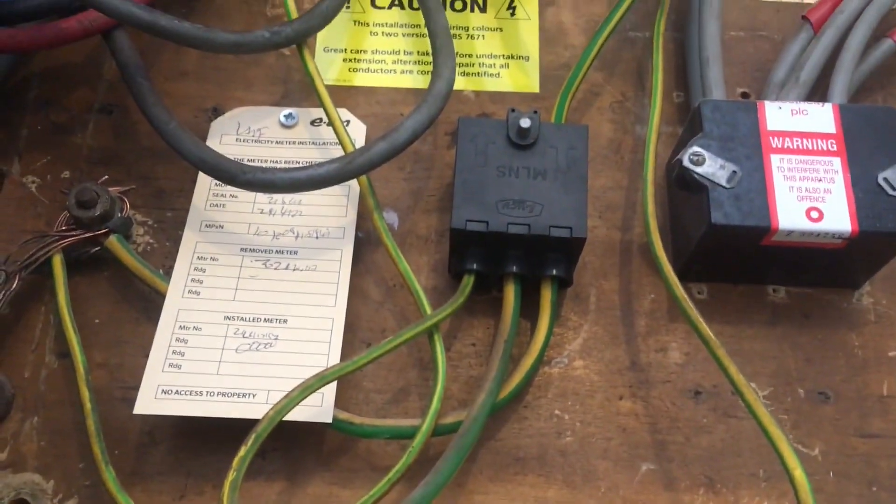Well, the guy's just been to inspect the wiring. He had a look at it, checked we've got an earth, checked I haven't been installing sockets on the lighting circuit or anything like that, and then said call me when it's ready for the second fix. So I've passed the inspection. Hardly seems worth the lots and lots of money, really.